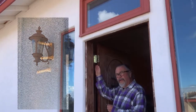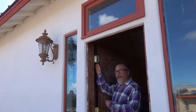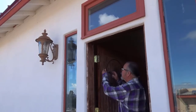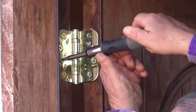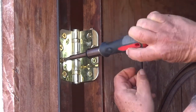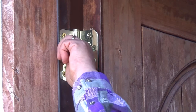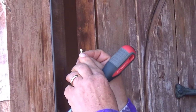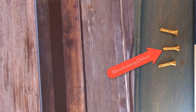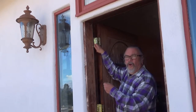I'll show you some of those in a little bit, but I'm going to now take out the replacement screws and I'll show you the little trick that I use to make this hinge a lot more secure. This screw is perfectly fine. I'm going to use some matchsticks and wood glue to tighten the hole in the frame.